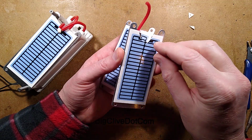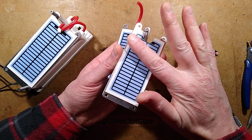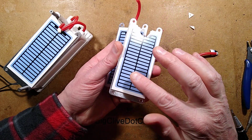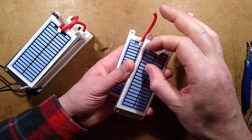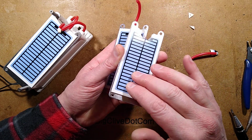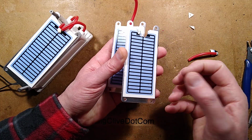They've got a conductive ink that has the black sort of layer, but then they've put, this is the active corona discharge area. They've then put a sort of coating over that, almost like it feels Teflon-y, which would make sense because it is fairly resilient to ozone.